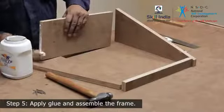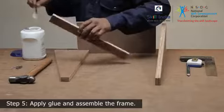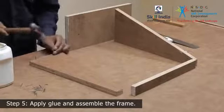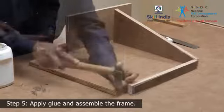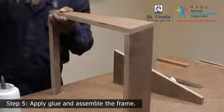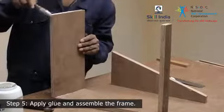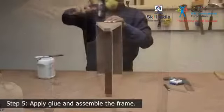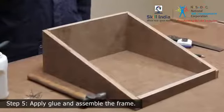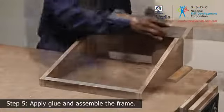Step 5: Use a brush to apply glue on the joining sides of all the pieces. Then hammer some wire nails into each of the side support edges — don't hammer them all the way in yet. Fix the rear support and the front support to the edge of the side support and hammer the nails all the way in. Fix the other side support in the same manner. Wipe off any excess glue with a damp cloth. Smoothen the top edges flush with the side support and ensure that the edges are flat for the strips to be placed evenly.